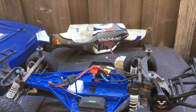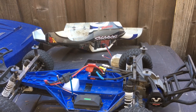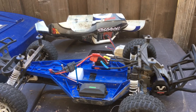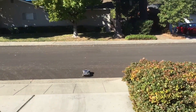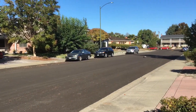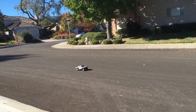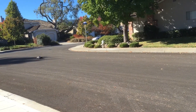After that, it seems like things have been restored. We ran it on a 2S pack and it seemed to be a lot faster. We're going to do a 3S pack now to make sure we're not getting that same stumble under full throttle that we were seeing before. Oh yeah, this is on 3S. That's the type of performance we should be seeing. There's no stumble in the ESC anymore.